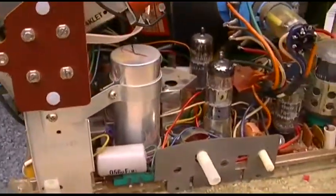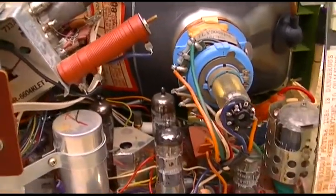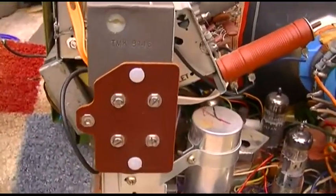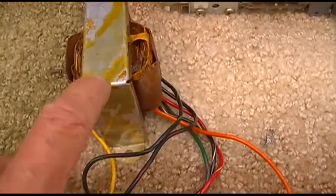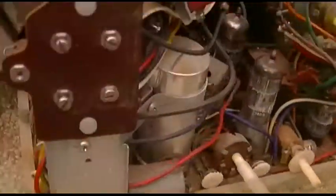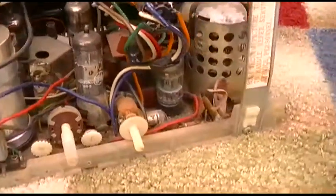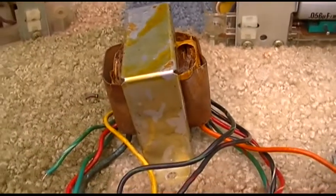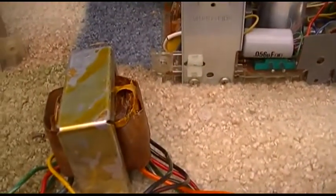They call this the Portabelle — this is the Portabelle Packard Bell vertical output transformer modification. Here's an extra one of the transformers. This roundy is ten-to-one, and this one from a rectangular set is about twelve-to-one. I calculated that by feeding 120 volts from the primary into the line and measuring the secondary output.